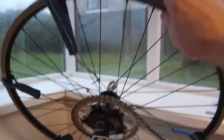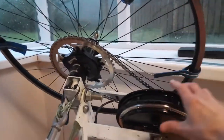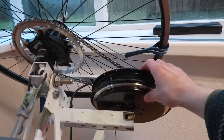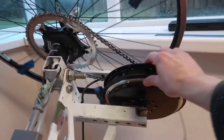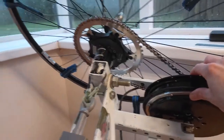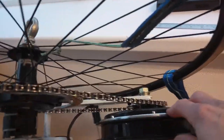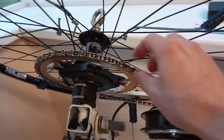Now the kite, as it's going around, spins clockwise — that whole set spins like that. You've got a fairly standard 500 watt bike motor there, which has been generating at over a kilowatt and a half, so it's done very well. The link onto that is standard bike stuff, but we've got a track chain there — a fairly strong standard for a bike chain.